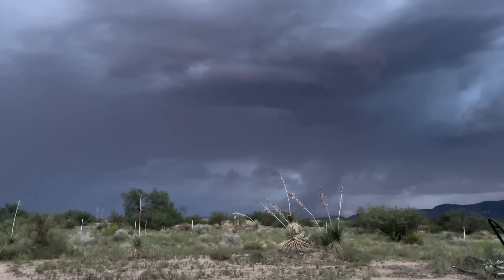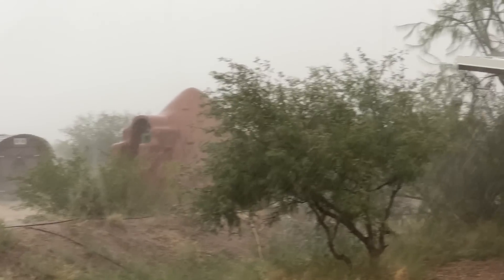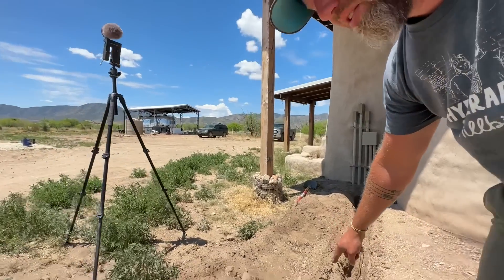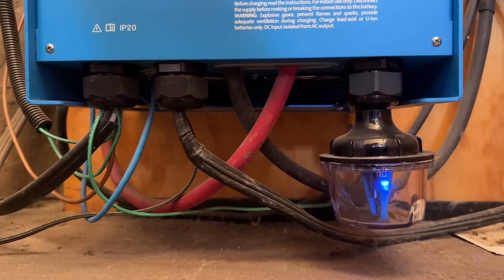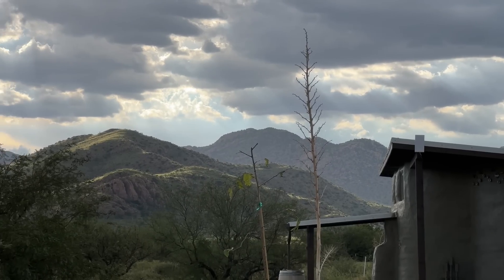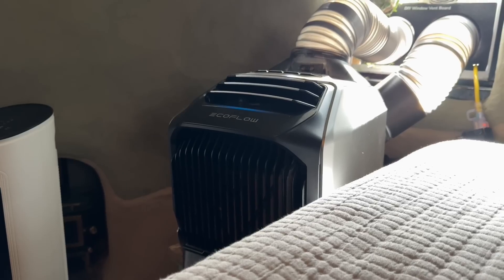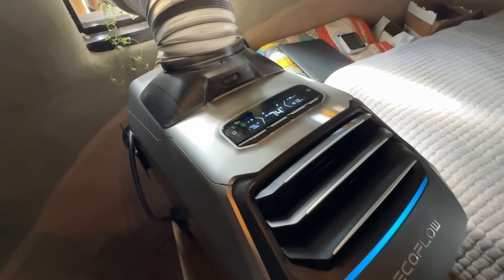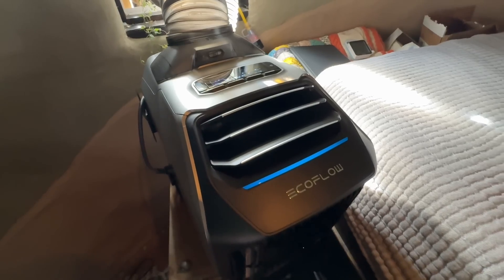Now, I didn't just want to discount the battery that the Wave 2 came with — it's a good-sized battery bank. Surely, there was a better use for it. Once we realized that we needed to run it all the time, that use became more clear. During monsoon season, we have high temperatures and epic storms. With our wide open spaces, indirect lightning strikes are a real danger. In fact, our first year this happened to us and caused significant damage to our solar system. So in this video we actually worked to put in better grounding and some lightning SPDs. But honestly, if we're here on the property and a big storm comes in, we're going to shut off anything we can just to be safe. So if the Wave 2 has been cooling the dome all day and a storm comes in, we disconnect the AC power and can still keep running off battery in eco mode for up to eight hours, which is plenty of time for the storm to pass and the temperature to remain the same. Then we can just plug it back in like normal.